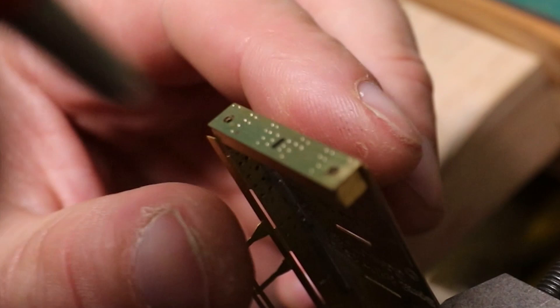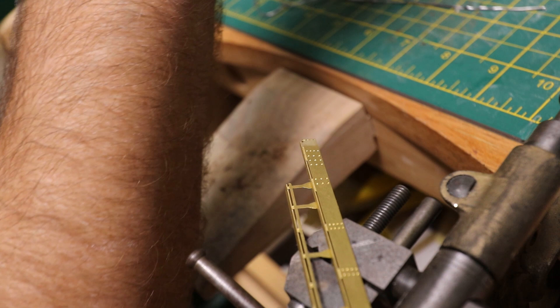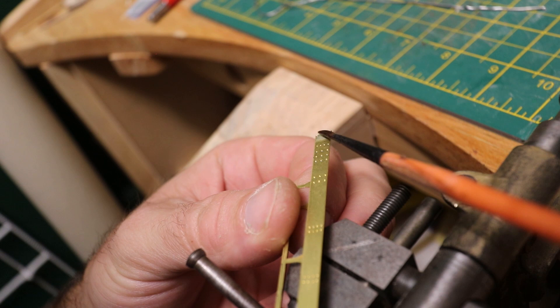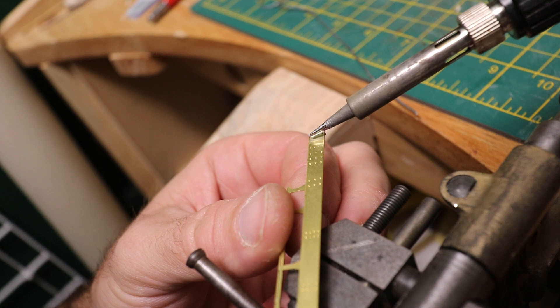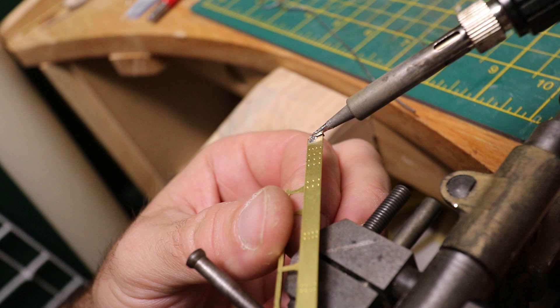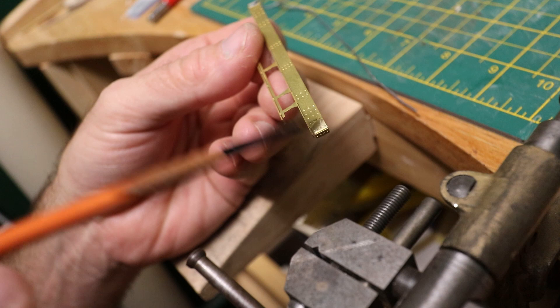Using the fiberglass pencil to keep the parts nice and clean and shiny. The next little thing is fitting the sole bar to the chassis that's already been constructed, so I'm just tinning that. I'm working around the camera here so I'm a bit fingers-and-thumbs — it's like I'm cuddling the camera mount. I'll flux that up and drop a bit of solder on there to create a little solder pad. I should do the same at the other end, and then that will be ready to fasten onto the unit that's already been built. Again, I'll use the resistance soldering unit to do that.